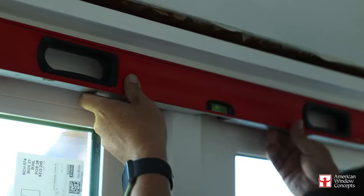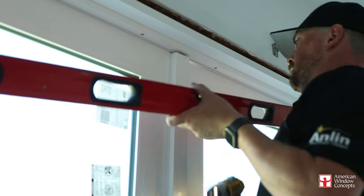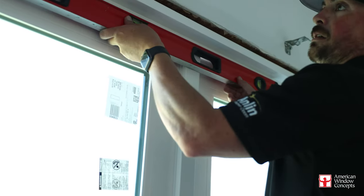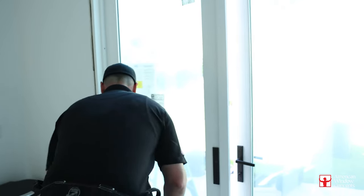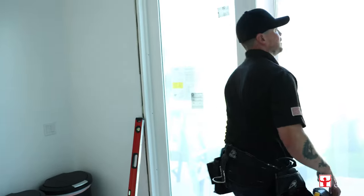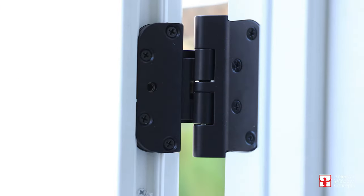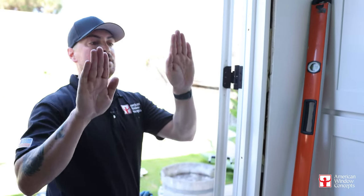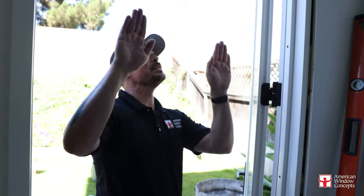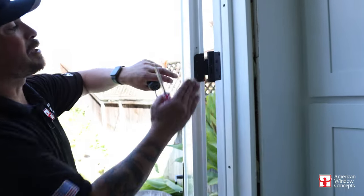What I want to do is check the crowning on this. A couple little pops there and we're looking good. There's no gaps there. Now, these hinges are adjustable on these doors — it's a 3/16th Allen. This doesn't move, and then you have an Allen at the bottom there. This will allow the door, in its opening, to pitch side to side, in and out as needed. Really, really nice hinge — super expensive. This is actually moving it out and in.